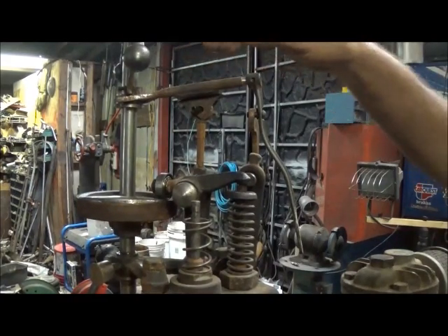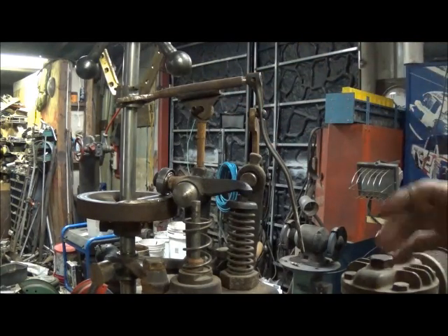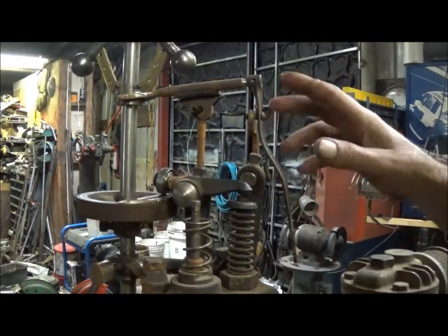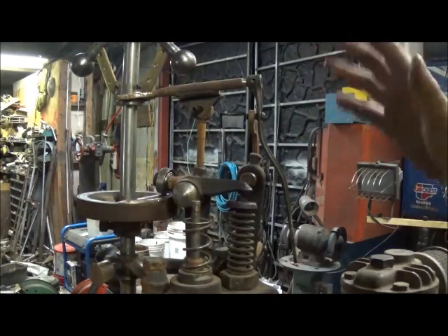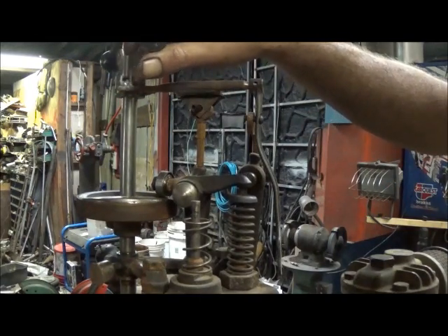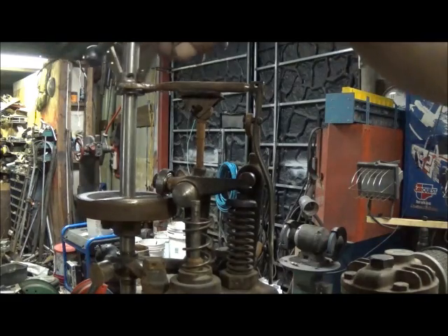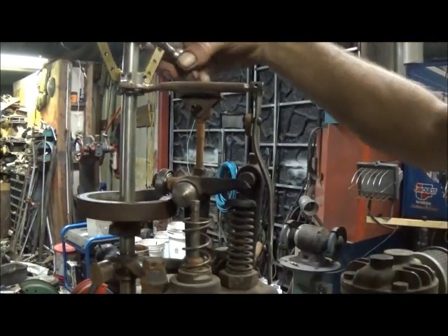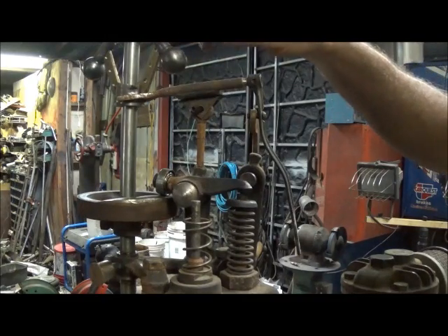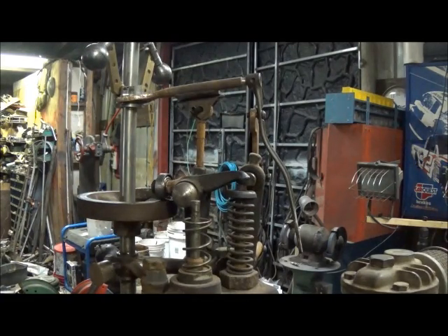This is the flyball governor at the top. When it's running at full rated RPM - 400, 500, whatever it happens to be rated at - these balls will actually come up. When these balls come up, it operates this linkage. All hit and miss engines have different style linkage. When the valve opens and this ball is up, it actually latches out. As you can see, the rocker is not opening and closing the valve - it's barely touching it but staying open all the time, so that lets the engine freewheel because there's no compression on it. That's where you get your miss. When the engine turns slow enough for these balls to drop back down, it unlatches and goes back to working. It's a pretty simple system - that's the way all hit and miss engines work.